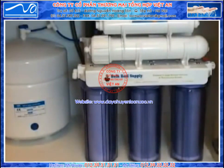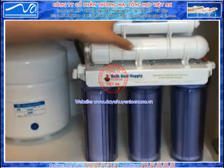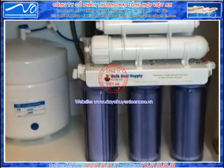You will need to occasionally change out the filters on your system. The first filter is a sediment filter — this is going to remove most of the large particles from your water, helping ensure that the carbon blocks don't get prematurely clogged, and should be changed when it's visually brown. The other two are carbon blocks and will remove things like chlorine and volatile organics; they should be changed every 6 to 12 months depending on use. The smaller filter on the top is also a carbon block, used to remove taste and odors, and should be changed when the other carbon blocks are changed. The filter in the larger canister on top is a reverse osmosis membrane and typically lasts around 3 years. You should change the deionization resin when you notice a change from blue to brown, or when you notice that it's no longer producing zero TDS water.